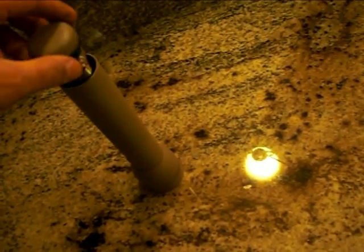And I didn't have this all the way off. I cranked it down into the light. I'm not going to be able to do this with one hand. Hold on a second. I had this in here like this, and I backed it off just a little bit. There you go. I backed it off just a little bit to where, if I had this tight all the way and I Duracoated it, it would seal this up, and I would have to kind of break it loose. So what I did was, on all the parts, like right here, and right here, I backed all this off just a little bit, just to leave a crack there, so it would continue to be kind of in two parts. I didn't want it to have a layer of Duracoat over that and then me have to break it loose and the paint job looked bad.